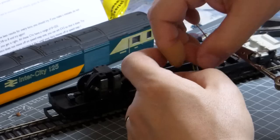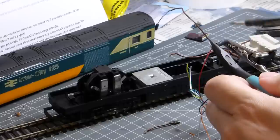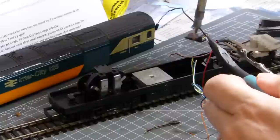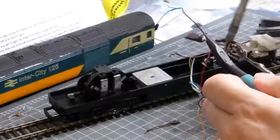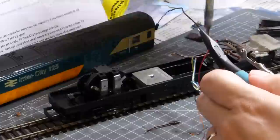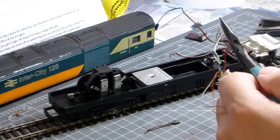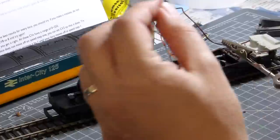Once happy with the joint, get your heat shrink sleeve and put it over the top. Use a pair of pliers to stop it sliding back down. Use the soldering iron to melt the heat shrink over the joint — it reinforces the joint and makes it nice and solid. Try not to touch the actual wire itself. Get all sides to make it shrink evenly around it. Wipe the soldering iron to get the molten plastic off. There we have the first joint done — a nice red wire with a nice connection. That's our first power connection made.